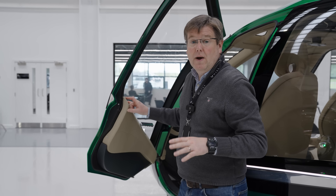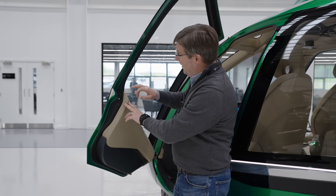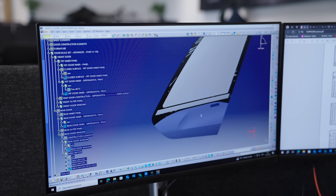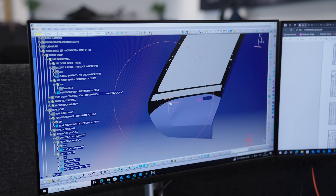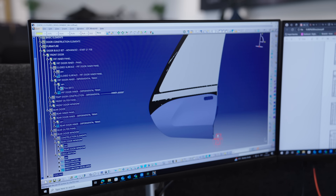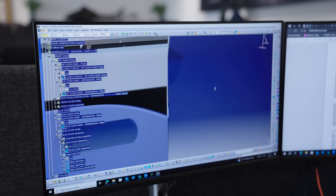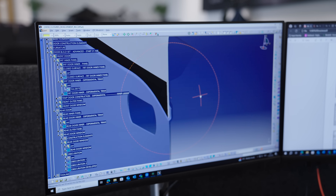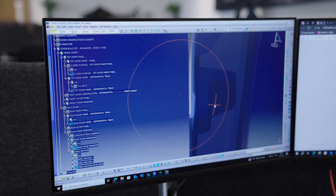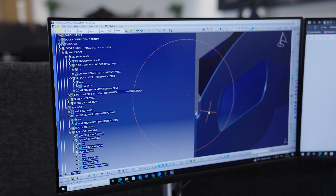In order to optimize the weight and stiffness of the panel, we've now eliminated the foam cores and we make a simple hollow channel that provides the structural beam running around the perimeter of the door. We then bond the window material directly to the outside of the door, closing off the box section and allowing us to develop the structural strength and stiffness that we need.